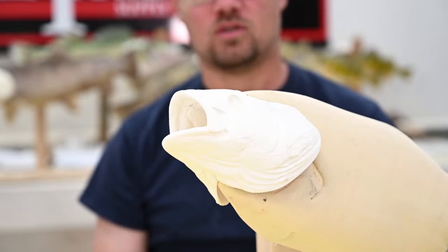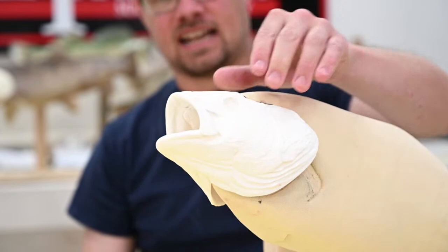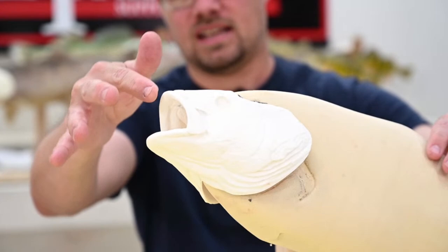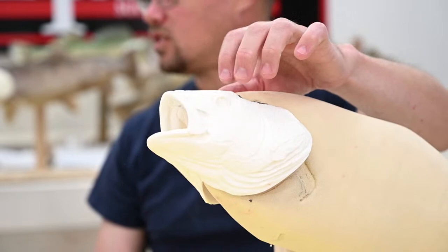If you use just round wires, taking it on and off several times, you end up augering out the hole, and then eventually your head doesn't fit exactly the same. By doing it this way, that head is gonna fit exactly in the same place every time, and we can minimize our finish work by joining this seam, and then we'll have just a crack there, and we can take the head off